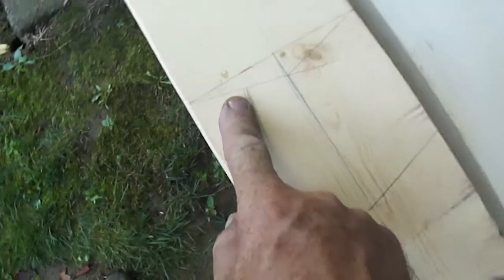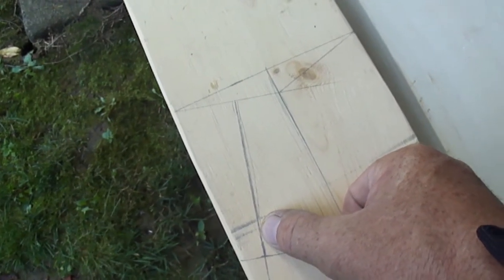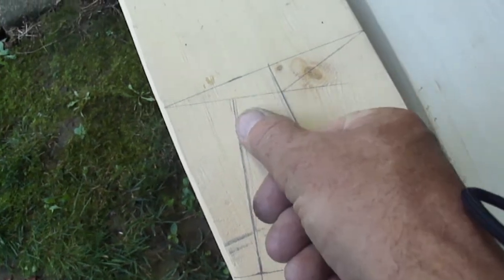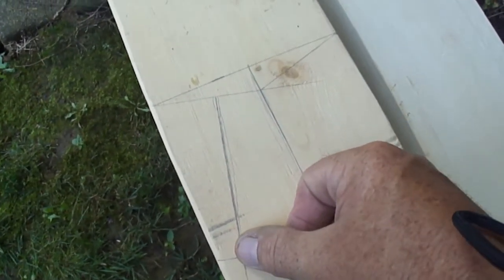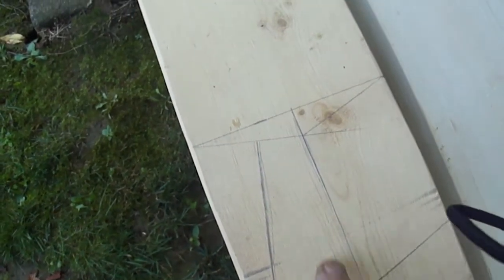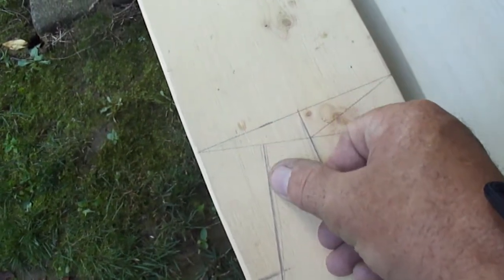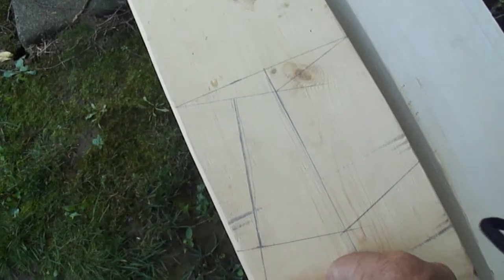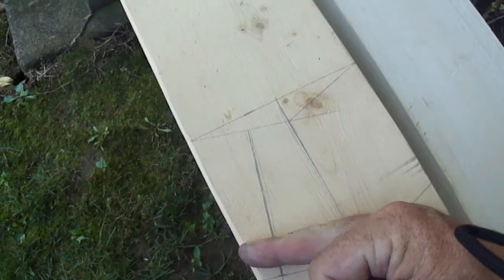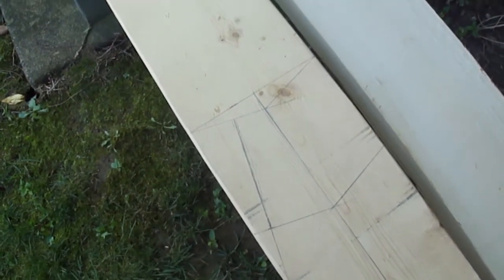Off of this angle, I've come down four inches. We're going to use a 2x6 full height as the rail, and I want it to stick up above an inch and a half. I've left a little mouth here of 5/8 of an inch. Come down four inches, and wherever that 5/8 hits, you're 90 degrees to that angled cut. This helps you — if you establish that angle good and saw it accurately, you can square down here such that when you're four inches down, you're 5/8 off the corner. That way it'll have a little shelf there for the piece that is our rail.